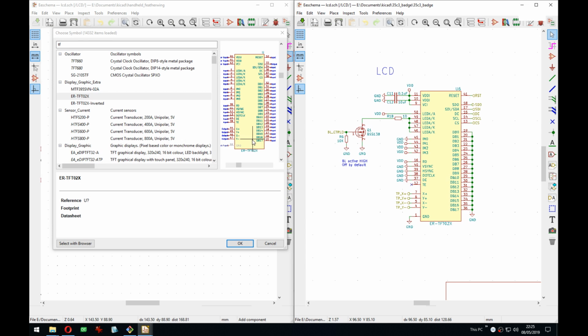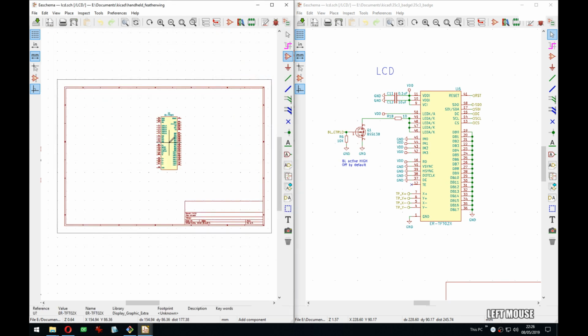And the reason for that was because of the PMOD connectors. I was actually running out of space on the back. If the connector for the LCD was there, it's quite a big one. It's 50 pins. So it was beneficial to have it on the front, under the display. But it was annoying because the display was then not flat on the board. And I think here I could actually do it again the way it was before, because I don't need so much space on the back. Let's do that, and hopefully I won't screw it up.